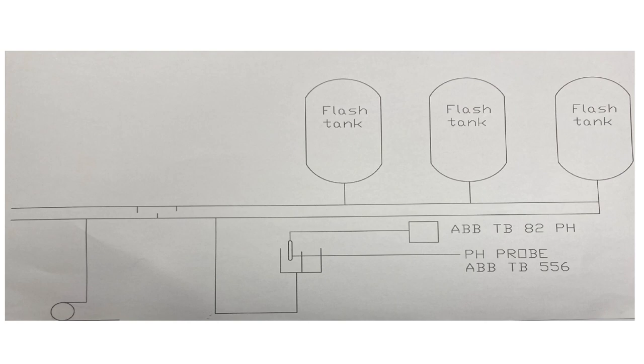As you can see, that's our pump metering the lime into the raw juice line. We have some obstructions which promote agitation before it actually goes to a sample line coming in. We have an ABB probe in order to detect the pH and meter the flow. The pump is on a VFD — it speeds up and slows down to maintain a certain pH. This is how Westfield Sugar has it set up.